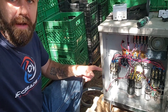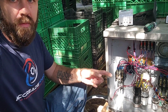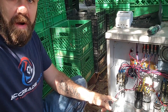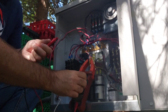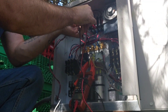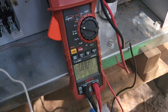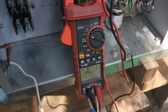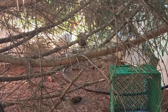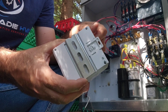Because our defrost is tied in remotely, we don't actually need this contactor or this fuse block. We'll leave the contactor for now and deal with it later when we tidy up the wiring. We're going to remove this fuse block and tie our monitor into that spot. Before we work on any equipment, we'll set our meter to the volt setting and check incoming power to make sure there's no power present. We're picking up zero volts incoming — and we've got some chickens creeping in to see what this HVAC guy is doing out here.